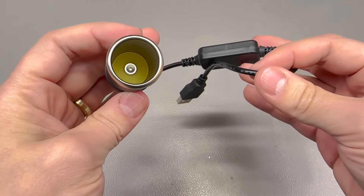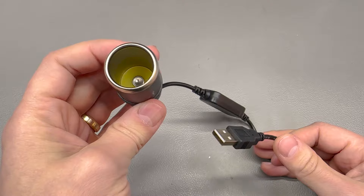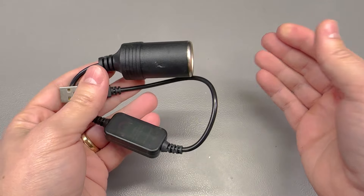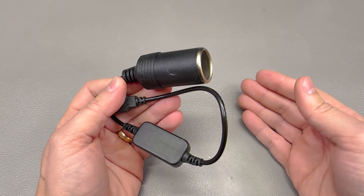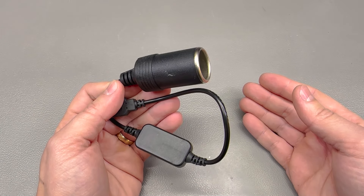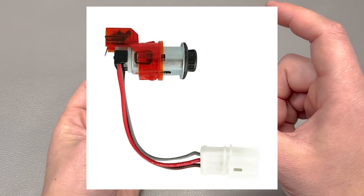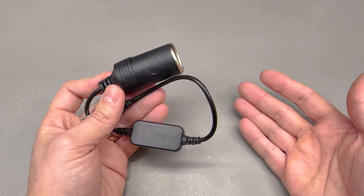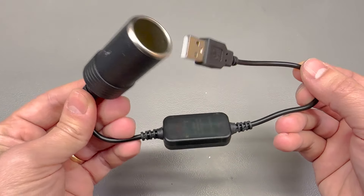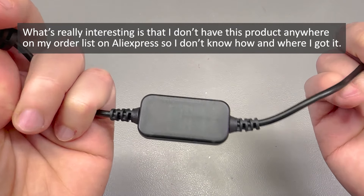The magnetic suction is very strong on this connector, the pins feel quite solid and thick, and they're spring-loaded on the inside part — so I'm liking this and can recommend trying it out. The seller rates it at 12 volts and 10 amps for the 2-pin version, which has a thick middle pin with the metal jacket as the second signal. For the 4-pin version I have, the rating is 1 amp per contact, which seems very reasonable and likely comes from the pogo pin contact ratings. Check out the link below.